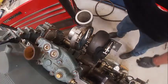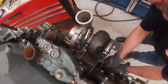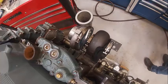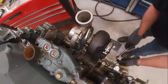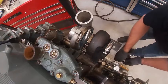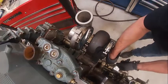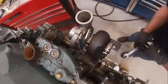This is where it gets oil from — it's off the oil filter housing. Turbo drain goes into the block here. I did tighten up the feed line to the turbocharger. This is a reusable line, so the only thing I'll be able to do here is hold it back so I don't round it off.